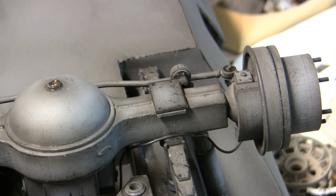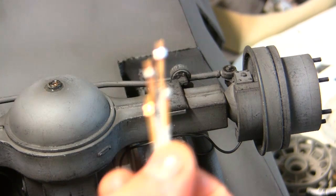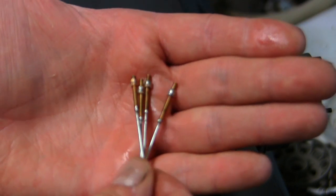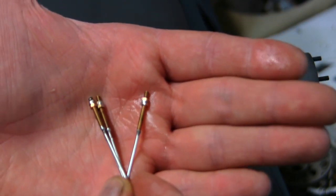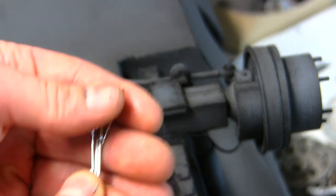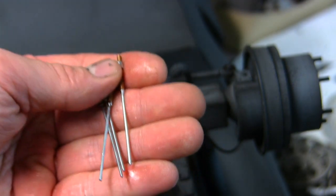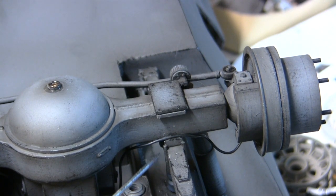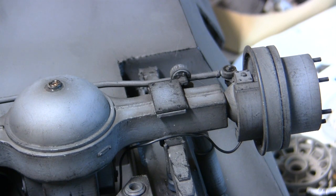In this cup I went ahead and soldered several of the fasteners that are going to be used for this detailing. Basically what these are: small miniature brass hex bolts that I went ahead and soldered a smaller hex bolt to the top portion. I also soldered a metal wire to the lower portion. The metal wire is going to connect the threaded section to this portion over here, because the length of the fasteners I have aren't going to be long enough to fully reach the bottom portion.